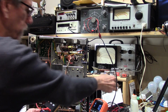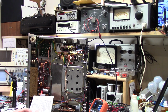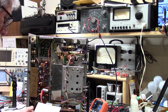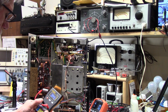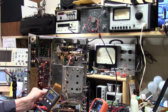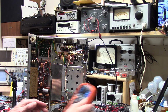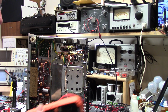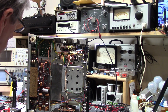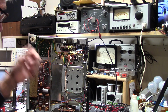0.050. And this is, I see you were, I just read it, 220, 50 volts, 220, 50 volts, and that says 0.2, and this is, oh, we aren't getting good connection, that's what our problem is, 0.05, so that's, the Elna brand seems to be very good. Interesting. And I don't recall that brand. I'm not familiar with that brand name, but whatever. It seems like that was a good quality product. Because this is way lower ESR than the specs call for.